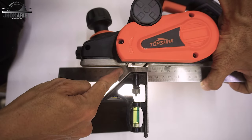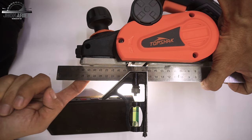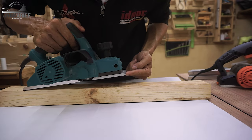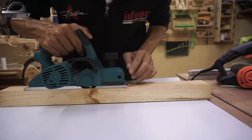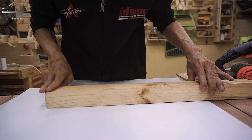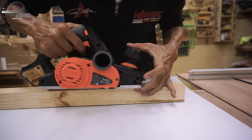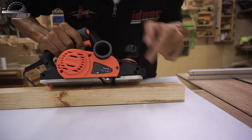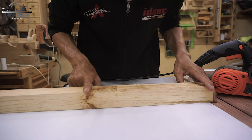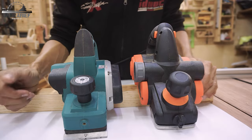You can see the gap — the front base plate adjuster is different. I have two planers with different defects. For this brand, the front end is lower than the back end, so the result on your planing is you're going to have snipe on both ends. In the other case, the back end is lower than the front end, so you will have a lower cut in the middle of your work object. These two have a different kind of defect.